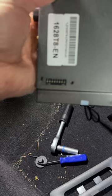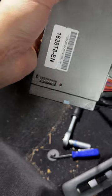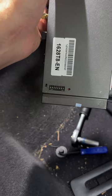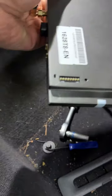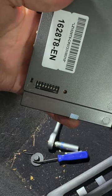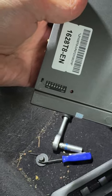Also very important: the DIP switch. Try adjusting the DIP switch before doing anything else — connect, see what's happening, and check the DIP switch chart which I will include. After changing the DIP switch, you need to press this reset button here — take something small and sharp and press it. The module will restart and the changes will take effect.